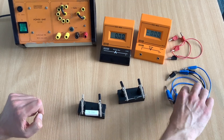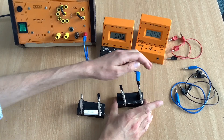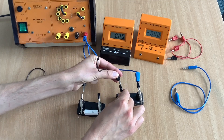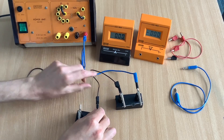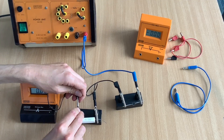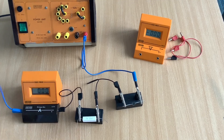The first thing we're going to do is connect from the positive terminal of the power supply — that's the red end — and go to the side of the diode which did not have the silver on. Then we're going to connect from the silver side end of the diode onto the resistor, and from the resistor onto the ammeter. Once we've got to the ammeter, we're going to connect back to the power supply, and that should form our main loop of the circuit.